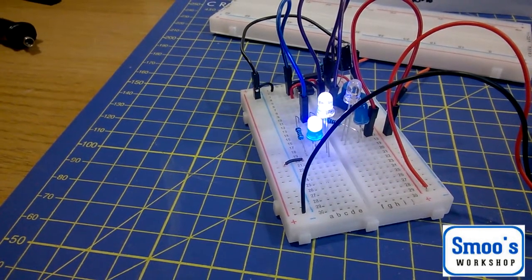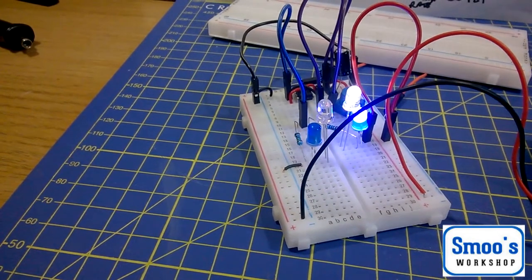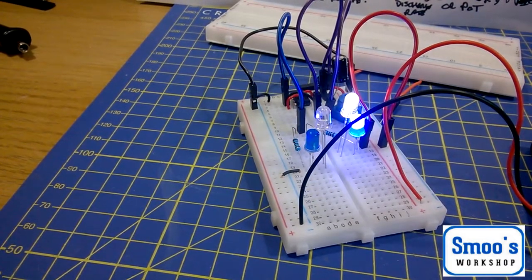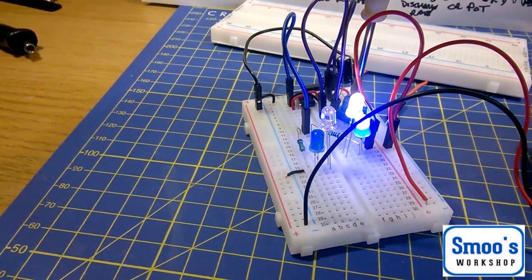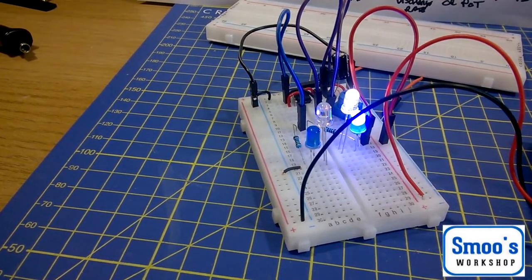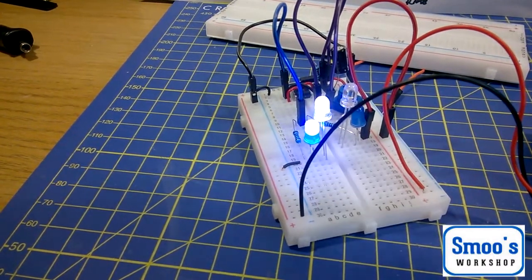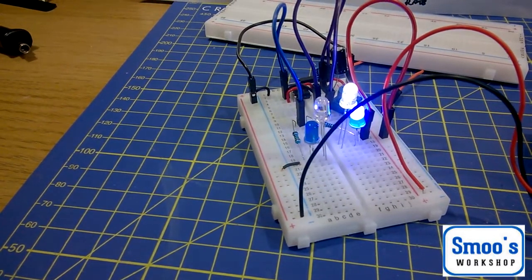So that's one of the reasons that I was experimenting with more than one LED on the circuit, is I actually want to do R2D2's lights. Although the LEDs in this aren't representative of the colours of R2D2, it's kind of what I'm wanting them to do. Probably flashing a bit too quick still. So just by changing the resistance, I can alter the delay of, if you can imagine, one side's red and then it goes to blue, and on the back green, yellow, all controlled off the one circuit.